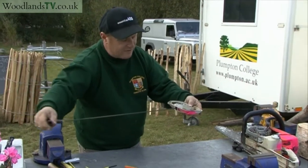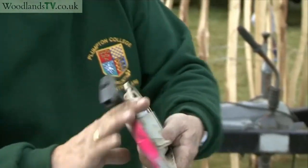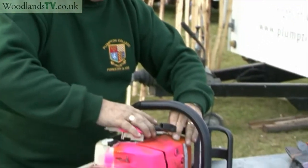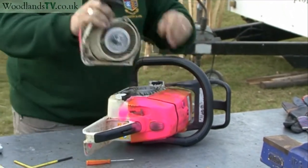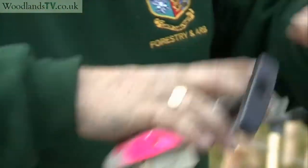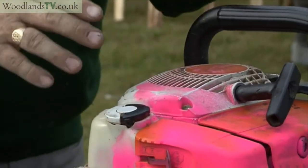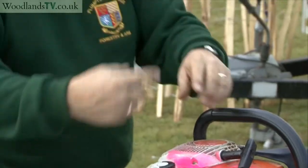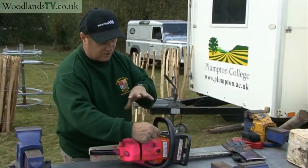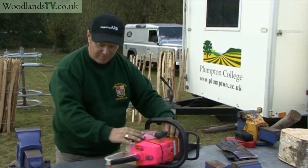Hold the cord and allow it to run back in slowly — you've still got that nice crisp finish. Pop it back onto the saw. With the Stihl it goes on very simply because there's a little locating tongue on the spool that just drops straight into the flywheel. On Husqvarna and some older models you have two little metal spring-loaded pawls, and when you put the starter mechanism back onto the saw you just have to slide it down with pressure, pull the starter cord a bit, and it clicks into place — otherwise it doesn't locate properly.